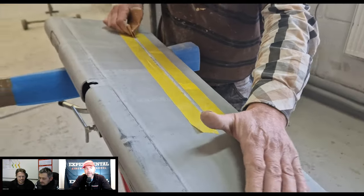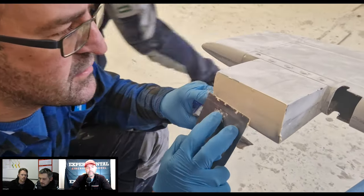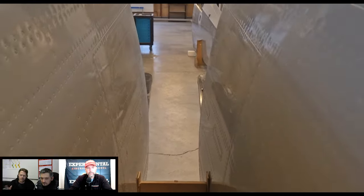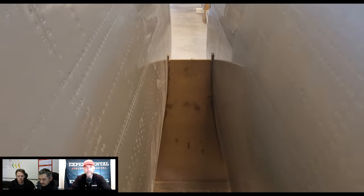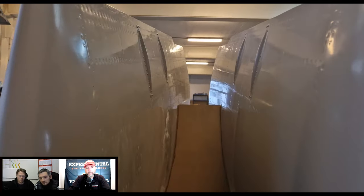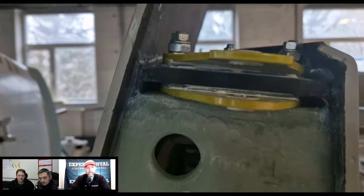As far as the landing gear and what other hard parts or weldments? Yes. Most of it is done in-house. Then we give it to outside companies for the most complex milling parts, just for speed, because they can make it faster in the bigger 5-axis CNC machines, but most of it we can do in-house. Then there are some external companies that do the anodizing and yellow chromate for the corrosion protection, and then here basically everything comes together.